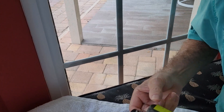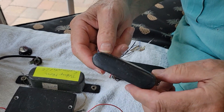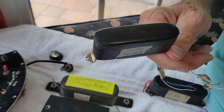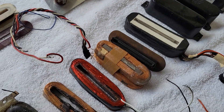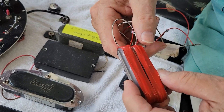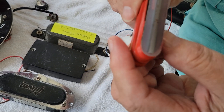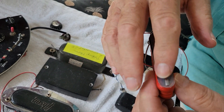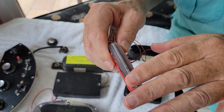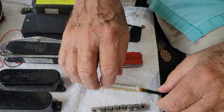Later on it came down to a pickup like this which is more high impedance — he was wondering how he could make a high impedance pickup in the form of the original low impedance ones that are humbuck-style. These were also done in low impedance wire — 26 gauge wire, 250 turns on this one. This has a special pole piece that I helped design as well. It's actually a slot, and the pole piece itself is not the magnet — the magnet is actually on the bottom.